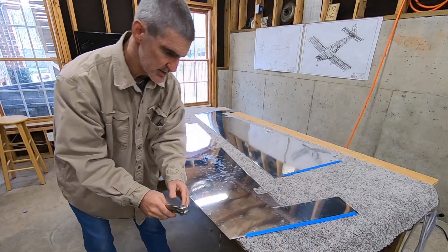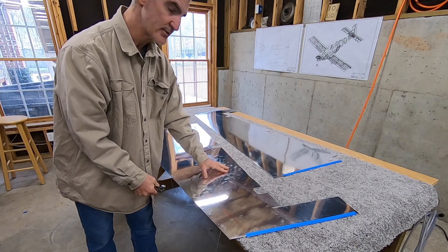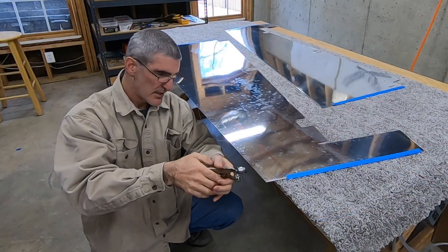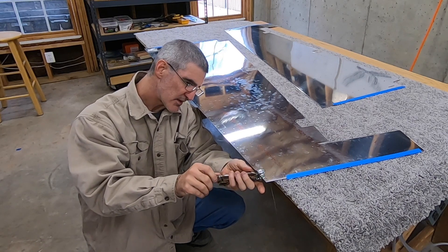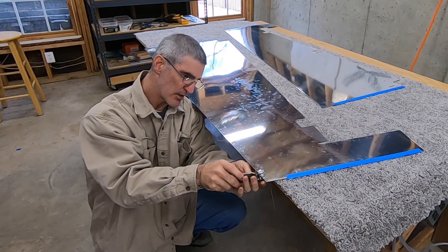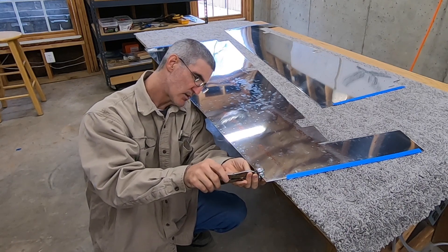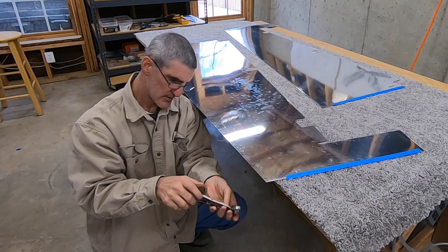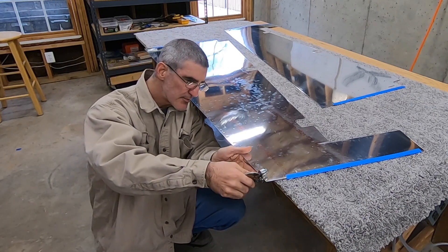To get this set up, first thing I want to make sure I'm doing it in the right direction. I don't want the bend to go in the wrong way. This is the top side or the outside of the skin. I want the bend to go this way. To get this adjusted, I'm going to clamp it down. It's not touching yet, and it's not far enough in to hit the bend in the bearing in the cone shape. Bring it down until it's just touching, and then a little tiny bit more.